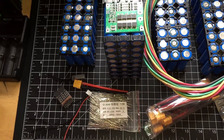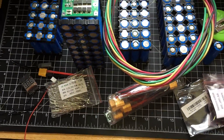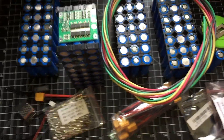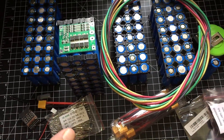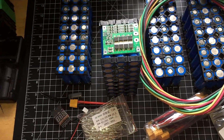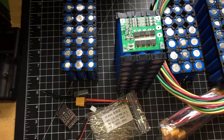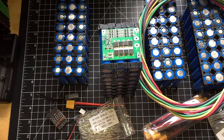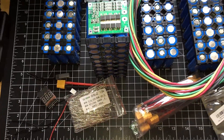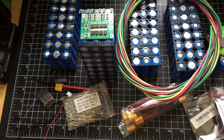For now I'll give the 1s a voltage alarm — if it goes below about 3 volts it'll alarm. These four and another four are going to be together in parallel with another 1s. Then there will be another eight 3s batteries with a 1s, and they'll run into a 100 amp volt meter. This plan should be pretty safe. I'm going to run load tests a couple of times — I've already tested them one at a time, and I'll test them as a complete battery bank to make sure they hold.